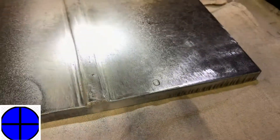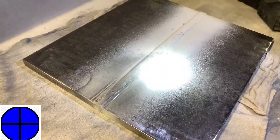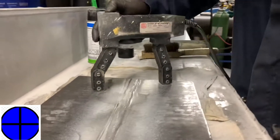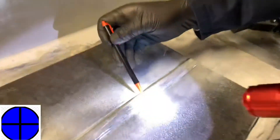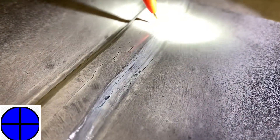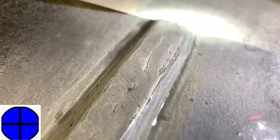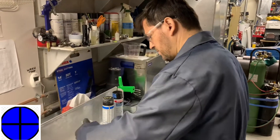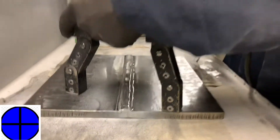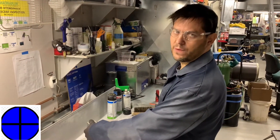You can see you're picking up these defects pretty good. This method is very sensitive — the wet is always more sensitive than the dry. We continue going across in one direction and noting our results. There's cracking across, some porosity on the surface there, and lots of cracking near the tail end. Toe cracking on the other side as well. The particles are still wet on the surface and will dispense in the direction needed from the magnetic flux leakage.